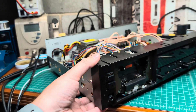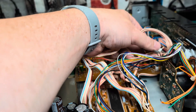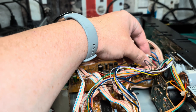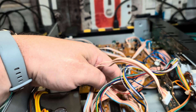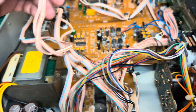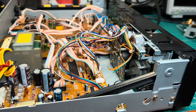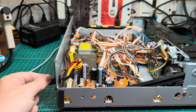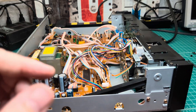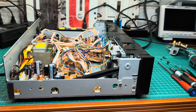The tape transport is installed back, but I haven't connected the playback amp yet — there are connectors here but not much room. I believe I can use a screw right here to fix the playback amp, same as last time. These two connectors will connect to the playback amp, and the power supply connection will be for tomorrow. I know all the steps now, so reassembly went quickly — now I need to make it run.